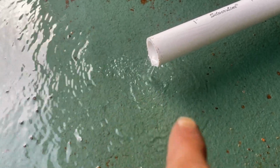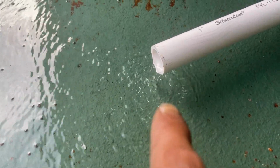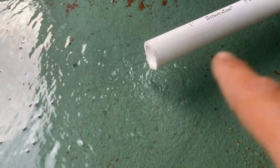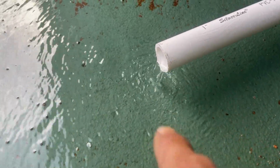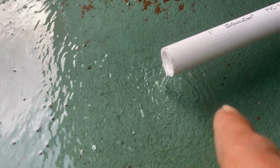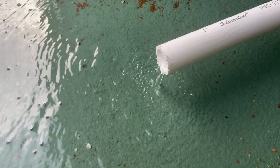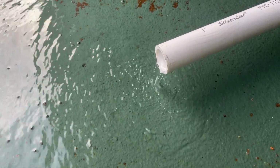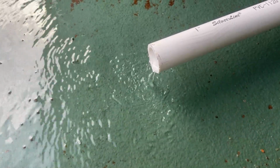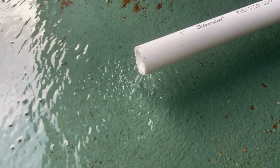All right, so we're back to draining, not real fast, but I went ahead and cut the heater loose. Now it's got air to flow through that tank to allow it to start draining properly. Remember, those old pressure relief lines, when they put them in the house, are probably clogged up with critters and nests and stuff. So we're not going to do that when we pipe it back in. But now, as you can see, once we cut it all loose, we have air flowing through that tank and it's draining.